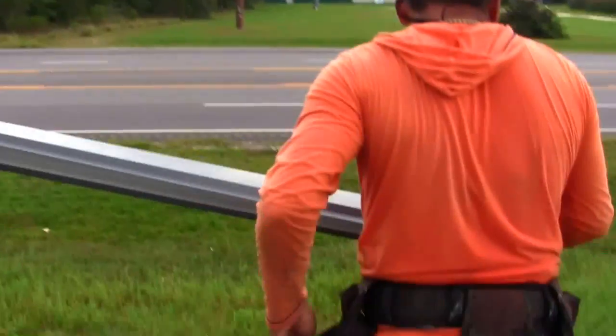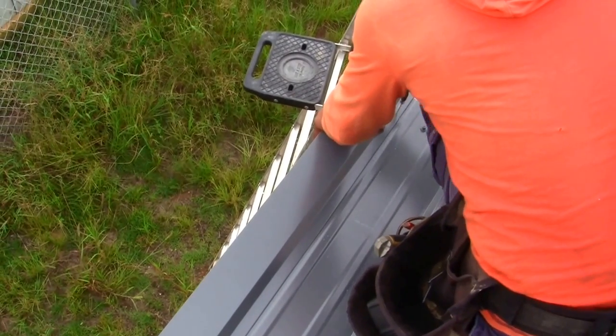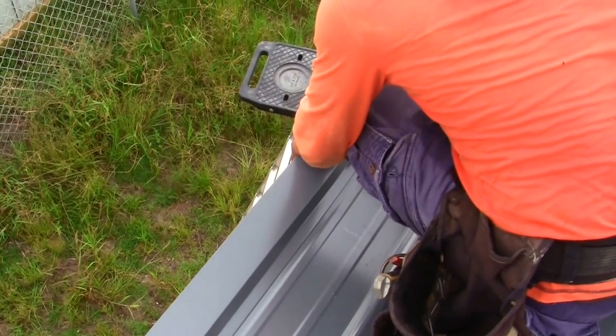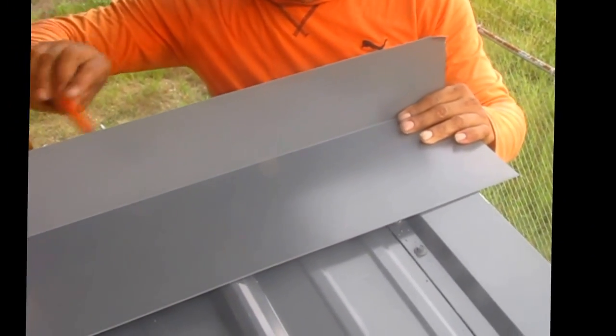Now install the gable trim. You need some type of sealant where the joint is and where the screw goes. This sealant is hidden. We chose not to use it since this is a display. You will need to install some more 2x6 nailing strips up to support your flashing and to give you something to screw to if you plan on putting siding between the two lean-tos. Next, install the end wall flashing as shown.